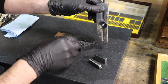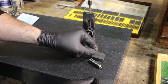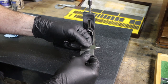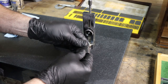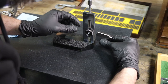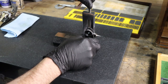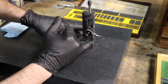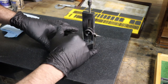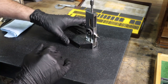Let me do a quick little demo. We've got our short stand and our height gauge base — that slides on there like that. I've got a three-quarter-inch gauge block and a three-quarter and a quarter-inch pointer. So we can wring those together. It's amazing how they stick together like that when the surfaces are extremely accurate — there's no oil on that, that's just the magic of wringing them together. We slide that stack into this holder and tighten it down. Because we know the base is one inch, and then we have a three-quarter-inch gauge block and a quarter-inch pointer on top, that pointer from the surface plate is two inches.